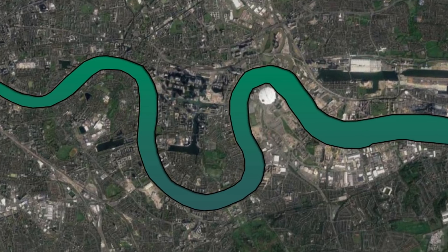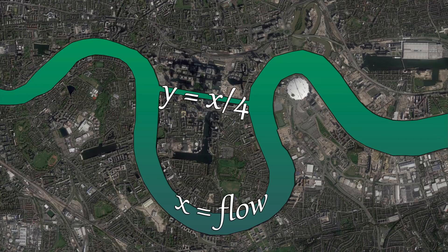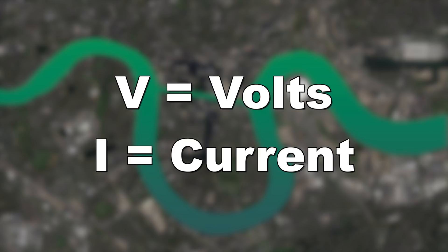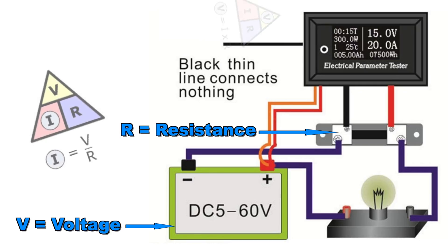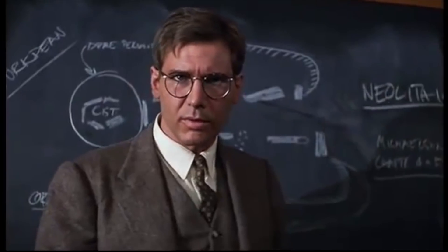Imagine you're at a fast moving river and you've been handed a bucket and asked to measure the flow of current by filling the bucket and counting the time it takes to fill, but this river is too powerful for such a small bucket. So you create a channel of a known depth and width between two points on the river. The water now trickles through the channel proportionally to the river but this time it's much more manageable with your bucket. This is similar to what happens with an electrical system: we utilize Ohm's law, V = IR, where V is volts, I is current and R is resistance. The shunt is the known resistance, and since voltage can also be measured from the circuit, the current can be calculated through simple maths — making this safer for the gauge's sensitive electronics.